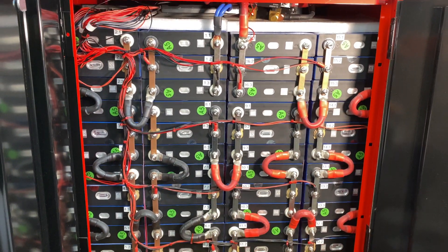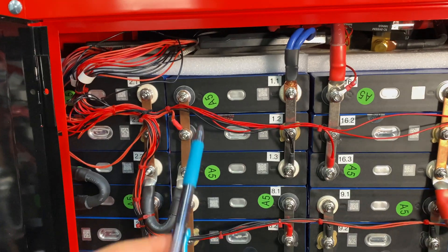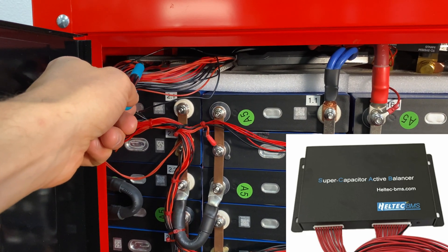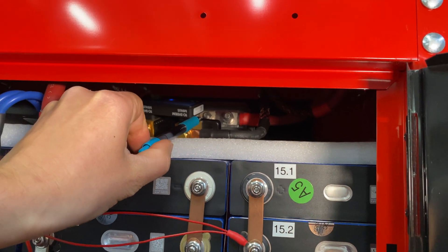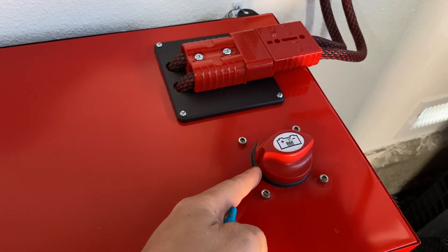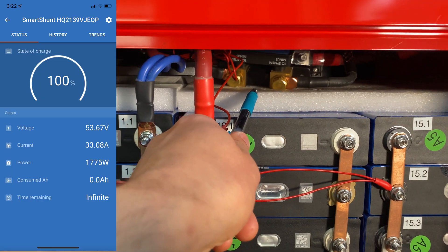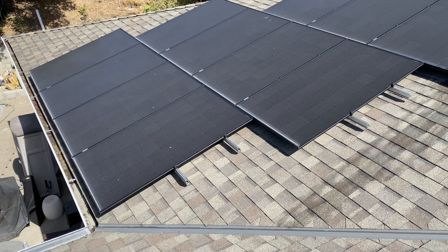The battery bank has 48 lithium iron phosphate cells with 455 amp hours capacity. On top of the box is a 200-amp JK BMS with an active balancer at 2 amps, and a Heltec active balancer capable of balancing cells at 4 amps. There's also a Victron shunt, a Class T fuse to protect the cells, and two disconnects — one to isolate batteries from the inverter and one physical disconnect for both positive and negative wires. I use three apps to monitor: Victron, JK BMS, and Heltec BMS.